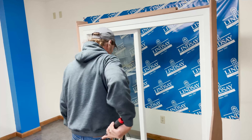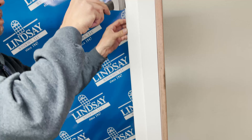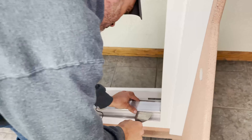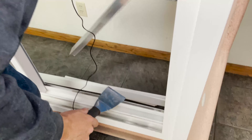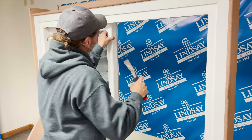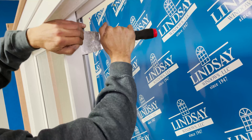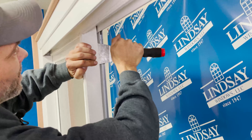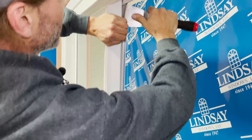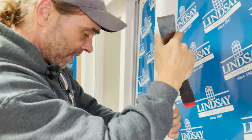Now for the frame, we'll have to pull these covers off and this threshold out. And then we'll pull this interlock off — just pry it out a little bit, get your bar behind it, and it ought to snap right off. Easier said than done sometimes, but there it went. It snapped right off, and we'll reuse that piece.